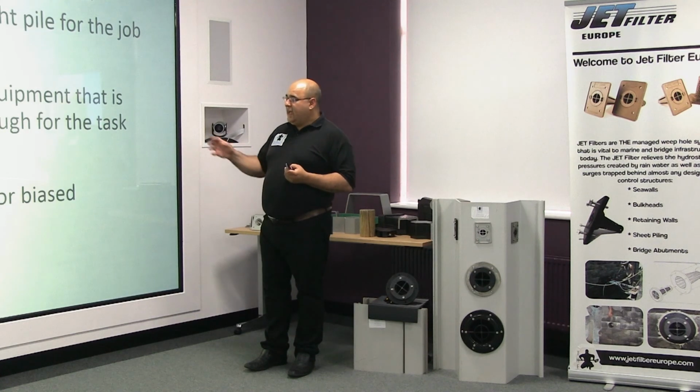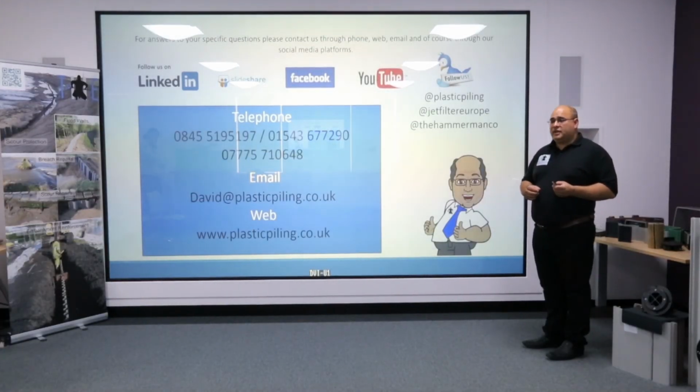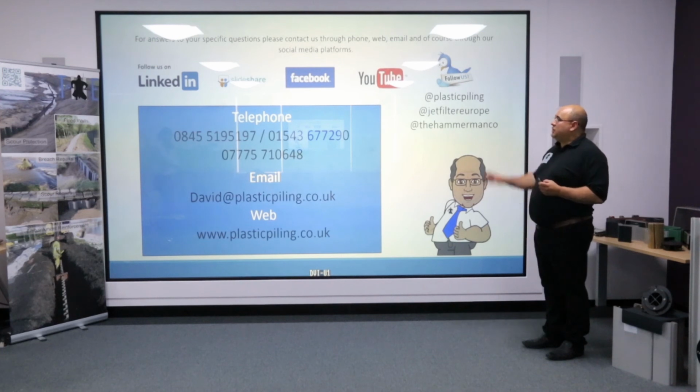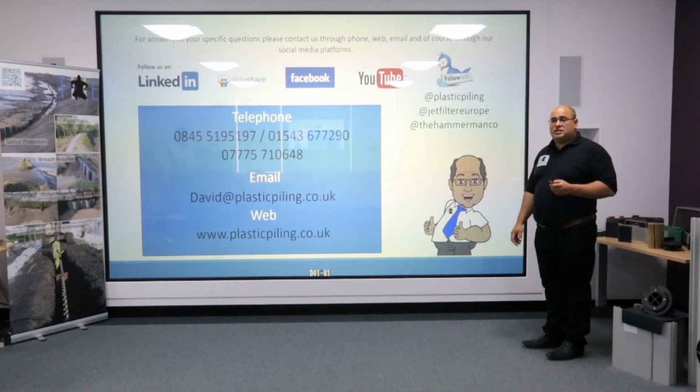Nowadays, if there's a problem installing plastic piling, it tends to be because the equipment on site isn't big enough to drive the pile into the ground. It hasn't got enough power to overcome the ground resistance. And as mentioned just then, we're very much vibratory based.